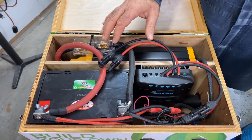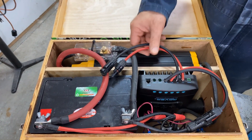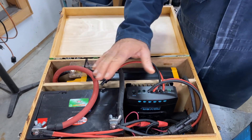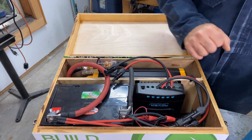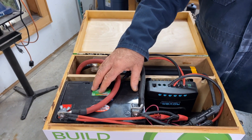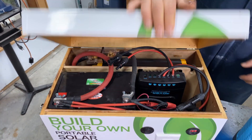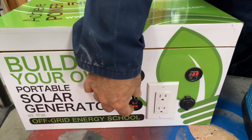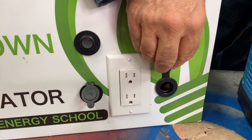There's one other component here too, called the charge controller. Like the manufactured one, this shop-built unit can recharge via solar panels — the solar panels connect here. But solar panels connected directly to a battery are no good; that's going to overcharge and damage the battery. That's where the charge controller comes in — it regulates the amount of energy going to the battery so the battery is not damaged. Those are the three components: the battery, the inverter, and the charge controller. I've also got a DC charging port and a vehicle-style power port.